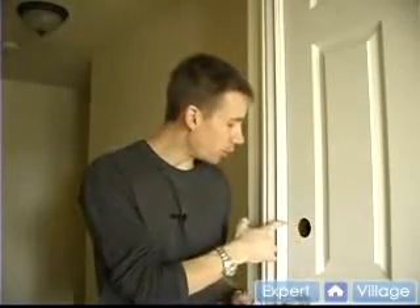What we're going to do is simply look through the hole here and through the latch hole also, and we're just going to eyeball the center, and we're just going to put a punch and mark it right in.